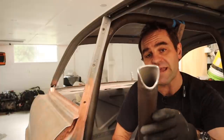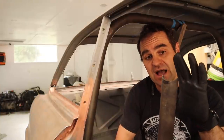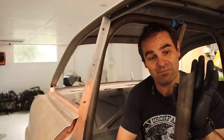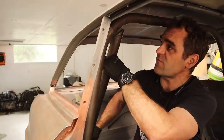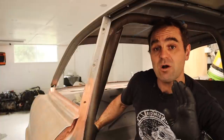I did a bit of cutting and grinding and I've actually fish-mouthed the end of this tube so that it will fit nicely up onto the bar. It's a bit of playing backwards and forwards to get this right and I don't actually have a tube notcher, so this is all done by hand. I was planning on getting a tube notcher finally for this cage — it's the third cage I've done — but I hadn't got it yet. I also wasn't planning on doing the cage this early as I'm still waiting on deliveries for other things. So now I've done the notching and it fits in here quite nicely. I'll take you through how I did it on the one for the other side.